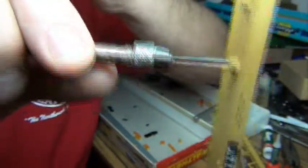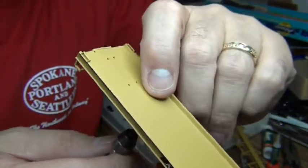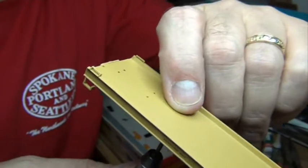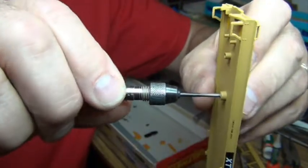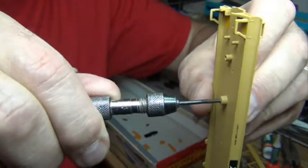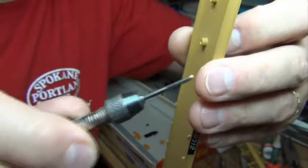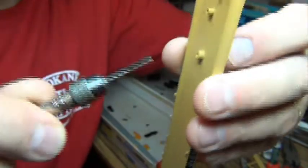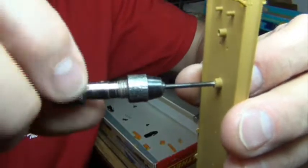The other thing you have to be careful of is don't try and twist it through too far, because you'll either make a dent on this side from pushing it in too hard, or you'll just go ahead and bust right through. Next thing you know, you'll have a big screw hole right through the deck of your flat car. Just a couple of turns at a time. You can feel it cut because it's pretty tough to turn, so you don't want to really force it too far. As soon as it feels really snug, stop, bring it out, clean the chunks off the end. You can see the yellow pieces of plastic on the end. Blow them off and blow the hole out because it's going to get stuff in there too as you're cutting.